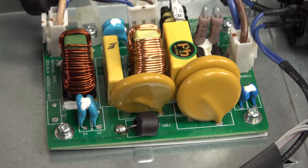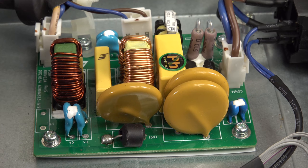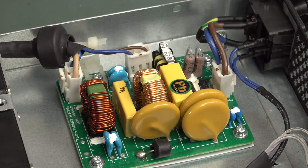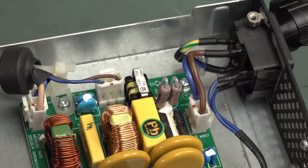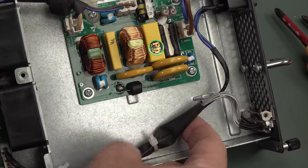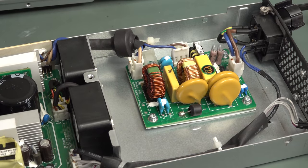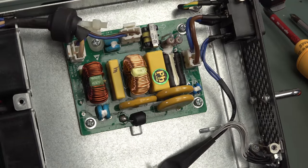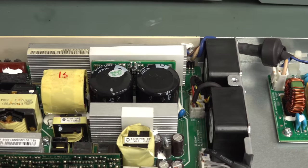So that's just super impressive. Wow. And is that a spark gap there? I think it might be. Brilliant. Belt and braces. And then we've got our multi-stage common mode chokes here. Absolutely fantastic. Look at the earthing up there, it's first class, of course, as you'd expect. Absolutely terrific. And look, they've individually heat shrunk all of the wires there. Just this ribbon cable going over here. They just didn't care about optimizing manufacturing cost of this. They couldn't give a rat's. And are those two input fuses there? Look at the input resistors there for surge. And it's just fantastic. You want to salvage that board, put it in your junk bin for sure.